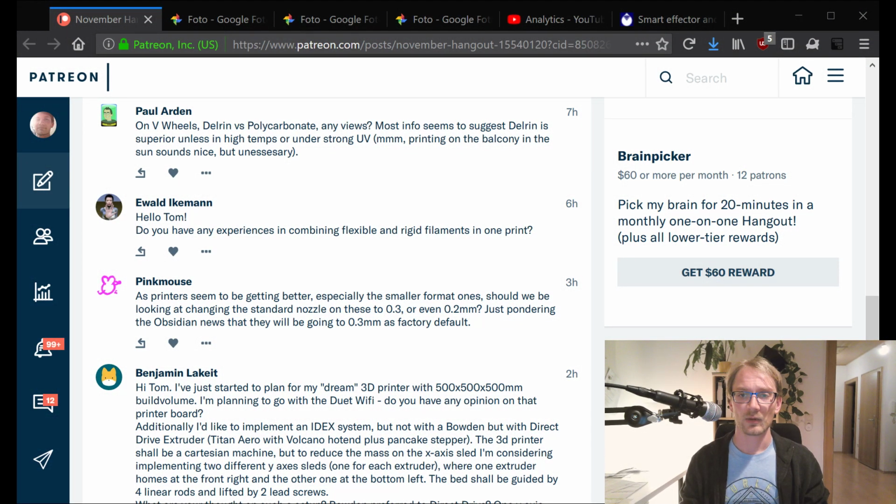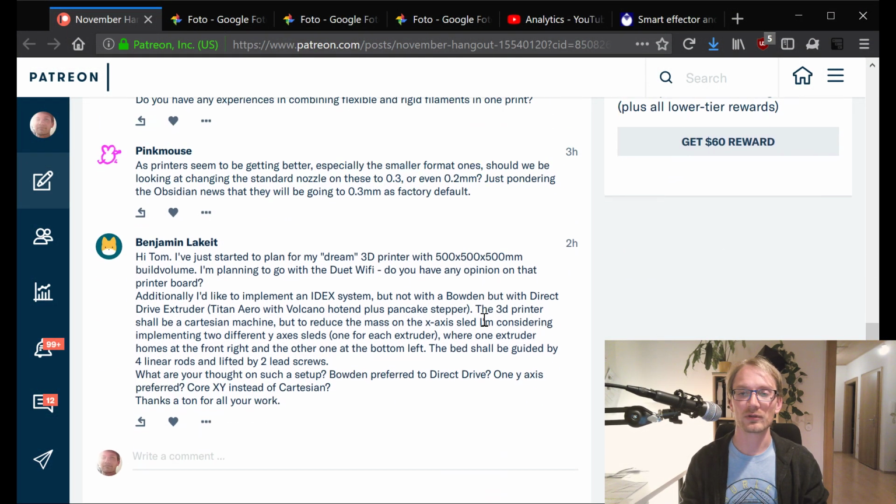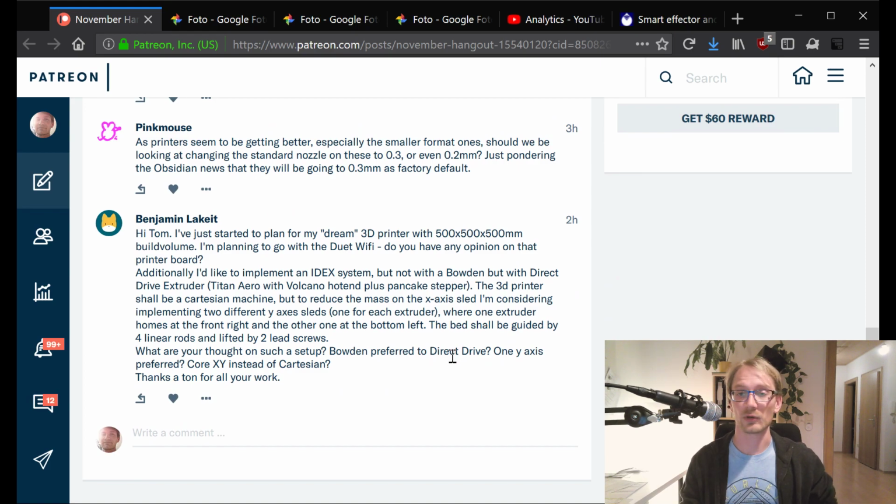Yeah, what else to note? I did miss the second question to last. We did already answer that: a question about whether the smaller nozzles should be default. We did already answer that earlier on. Again, I don't think you should be using 0.3 as a default because it's just a lot slower than 0.4. It doesn't give you a whole lot of extra detail reproduction.